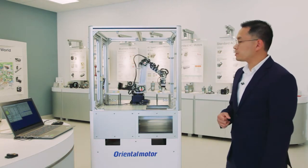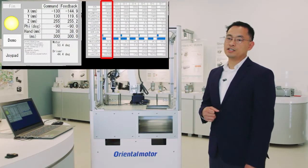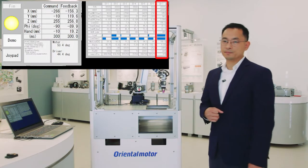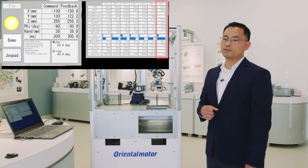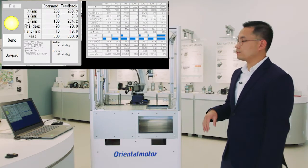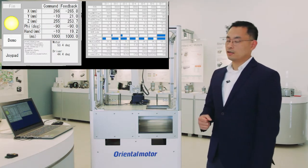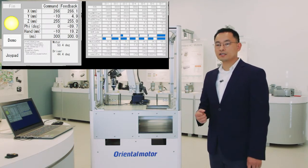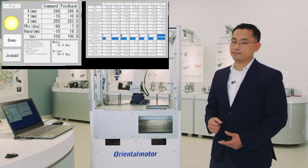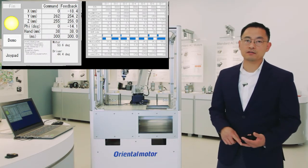Let's take a look at the screen to see what you can do with this information. Each column represents an axis — the first axis is the DG130 rotary table, and ID7 on the far right is our EH gripper. The blue bars moving back and forth display the load exerted by each axis. Below that row is the maximum output from the motor as the demo is running, and the percentage can also be represented numerically. Utilizing this information, you can monitor any sudden changes in behavior. For example, under normal operating conditions, axis 1 operates at about 40%. If all of a sudden this value starts to increase, it can indicate that components may be worn out or need servicing.